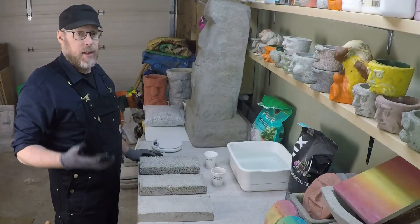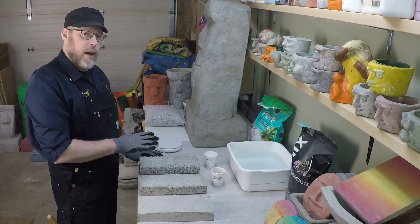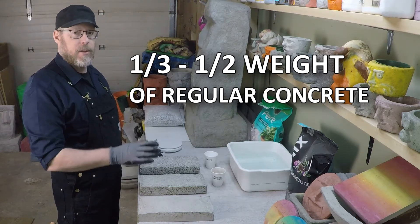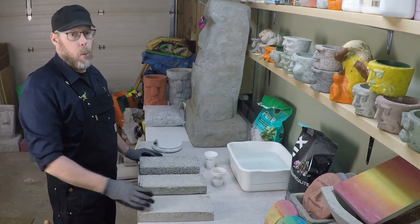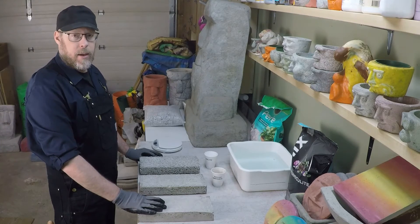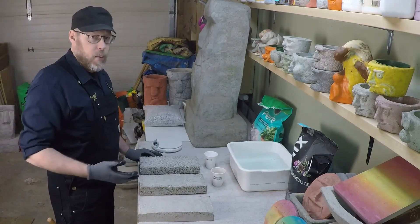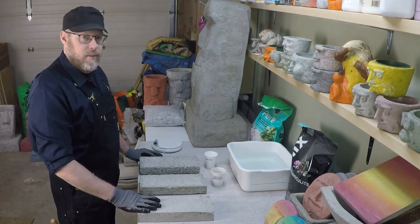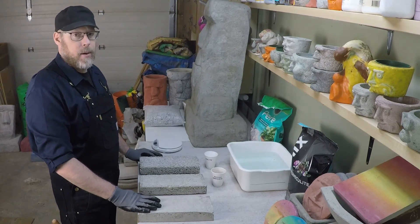There are a lot of different things you could make lightweight concrete out of, from peat moss to soap suds. Perlite and vermiculite are probably going to give you a product that's about one third to one half the weight of a full strength, full weight concrete or mortar mix. But it will also be much weaker — probably one third the strength, and honestly you'd be lucky to get that. As soon as you start making concrete lightweight, what you're sacrificing is strength. Any lightweight concrete mix — whether from soap suds, pumice stone, vermiculite, or perlite — will result in a concrete that is substantially weaker than any standard concrete or mortar mix.